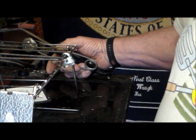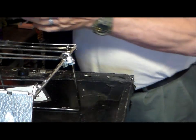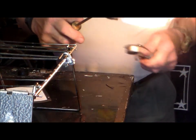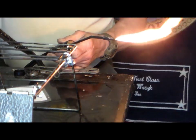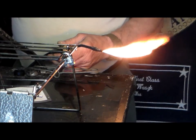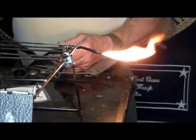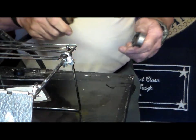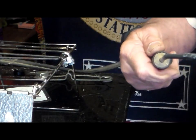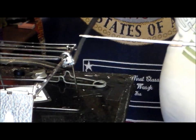Okay, going to give you a real quick lesson, a little bit of brazing. First we got to get it cooking here. Acetylene's on first, oxygen next, till we come down to a nice little hot flame. And that happens to me a lot. There's the flame. That's what I'm going to be using. Right there. A little hard to see. Brazing rod with flux already on it.